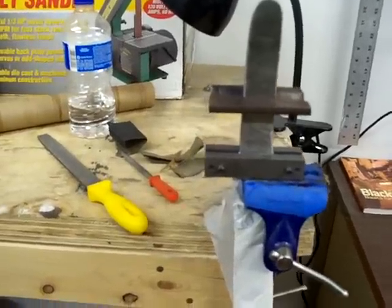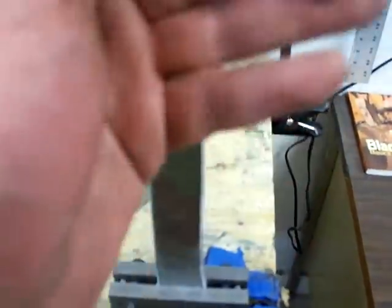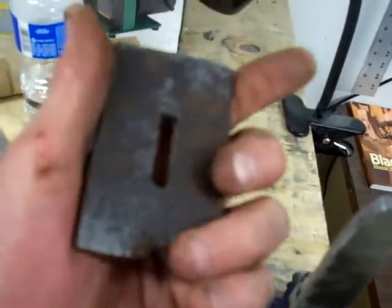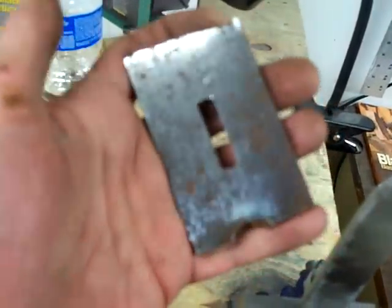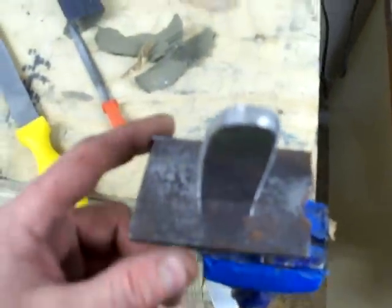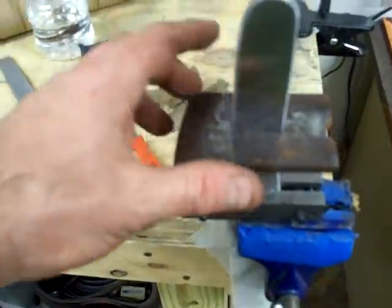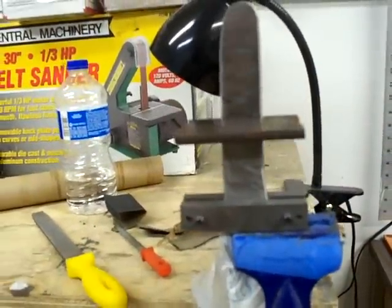Alright, I've been doing a bunch of grinding, filing, and drilling. There's my wrought iron — I cleaned it up just a little bit. Clean stuff for being a hundred years old. That's what's cool about wrought iron though, it doesn't really rust very much. You guys can see I'm getting a really tight fit there so far. Just can't be impatient and hurry this thing. A little ways to go — I'm not going to get it all the way there, I'm going to heat treat it first.